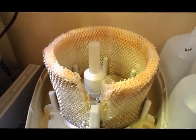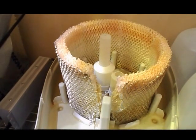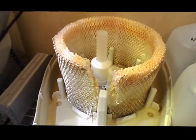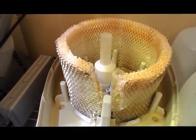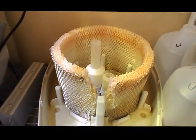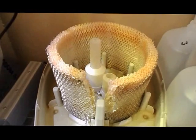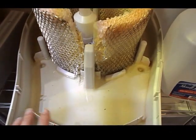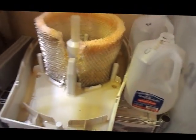I've also got an RO system. When you first turn on your RO system, the water is generally higher in TDS than when it's running normally — this is called TDS creep. Basically the membrane wants to have an equal amount of salts on both sides, so if it's been shut off even for about 20 minutes, the TDS will come up. What I do is for the first few minutes I just let the water run into a gallon jug and save that — it could be up to 200 TDS — and I use that water in the evaporative humidifier rather than waste it. I wouldn't use the waste water from the RO though, since that could be around 1000 TDS and would clog this fast.